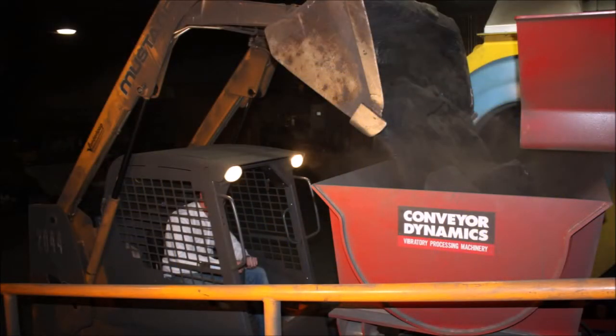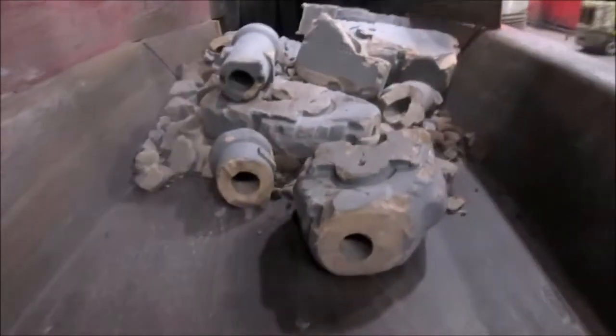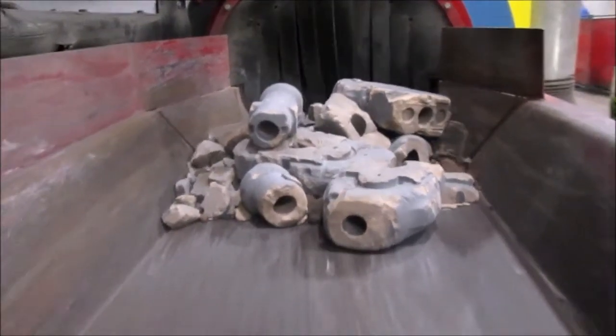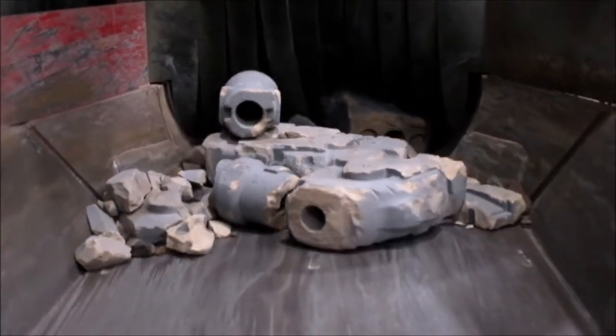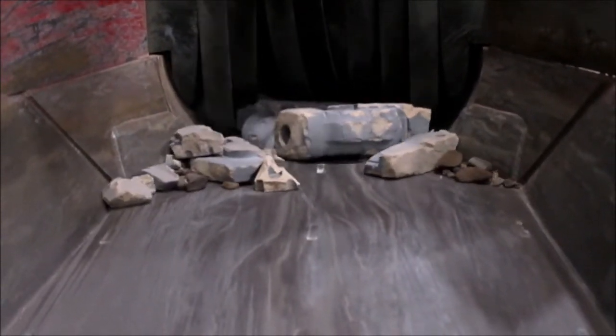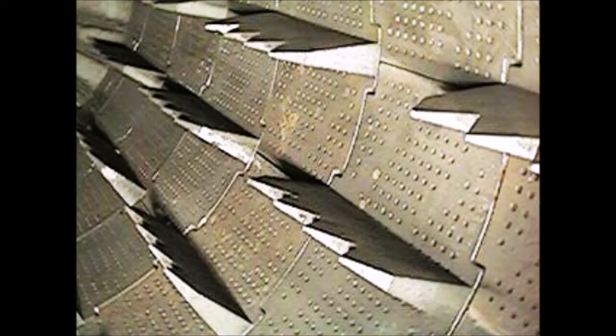Chemically bonded lumps are fed into the rotary reclaimer by means of a vibratory conveyor designed to accommodate the intake diameter of the Didion. High profile rifling at the intake end feeds large lumps into the attrition chamber while sand grains pass through perforations in the lining for transportation directly to the scrubbing chamber.